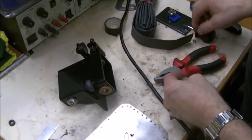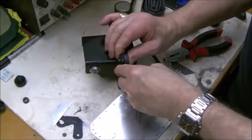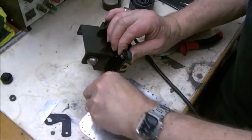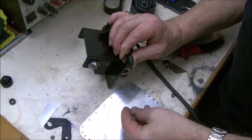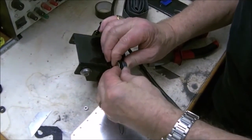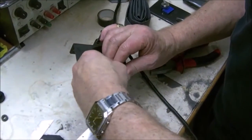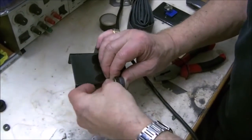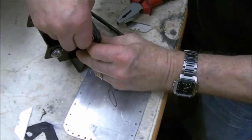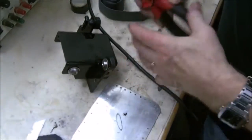7mm socket. Right. Bear in mind that the hole here is probably about 15mm. So don't go and use a standard M4 washer. Use a 20mm penny washer with a 4mm hole. That sounded really confusing the way you said that. Sorry. 20mm diameter M4 washer. Penny washer. The magnet, the washer, the nuts, all available on eBay.